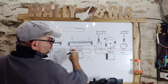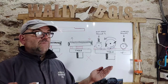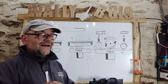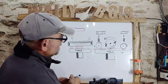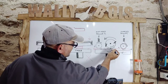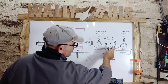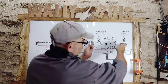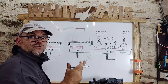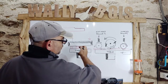So if you haven't supported your wood, let's say you're running a stair string through, and it's 3 metres, maybe 4 metres long, and you haven't provided it with enough support, what can happen is it can drop at the end, and then when it comes off this in-feed roller, it will go upwards and then become scalloped from whatever distance that is from there to the cutter block. For that length of timber, the closer the rollers are to the cutter block, the shorter the actual scallop is going to be. So it is quite important to make sure that you provide support for your piece of wood.